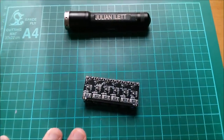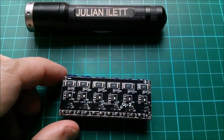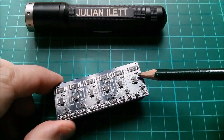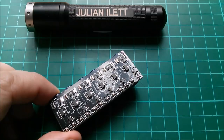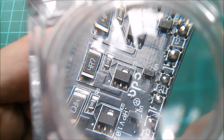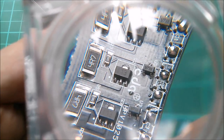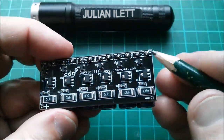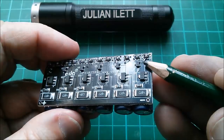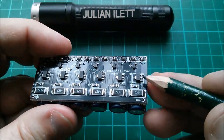This really is quite tiny — I need to zoom in. We've got discharge resistors at R7. I'm pretty sure the I13 component is the MOSFET, and this device marked M73X rings a bell as a voltage detector — I think 2.7V. I'll look it up and get a datasheet. Searching for M73X brings up 'voltage detector IC' and I13 comes up as a MOSFET, though I can't find direct datasheets.